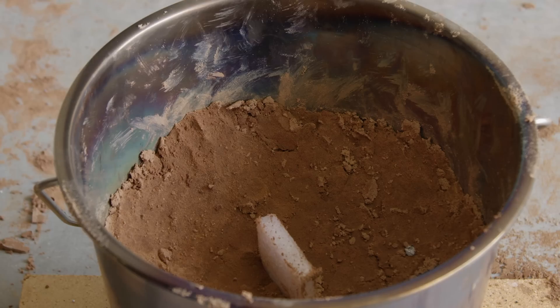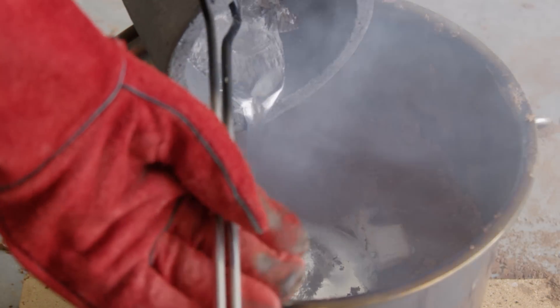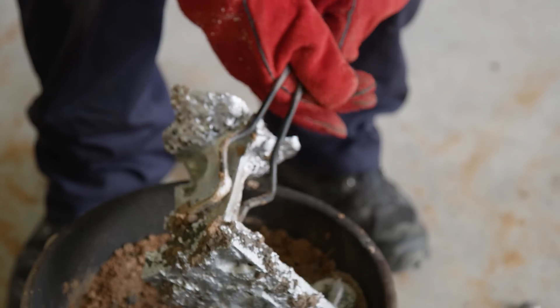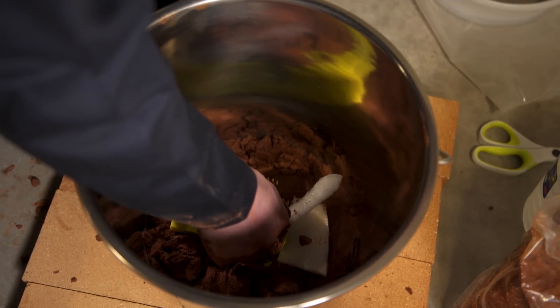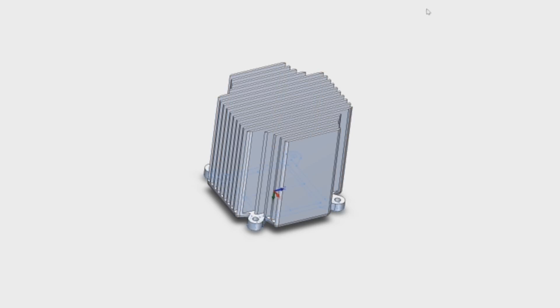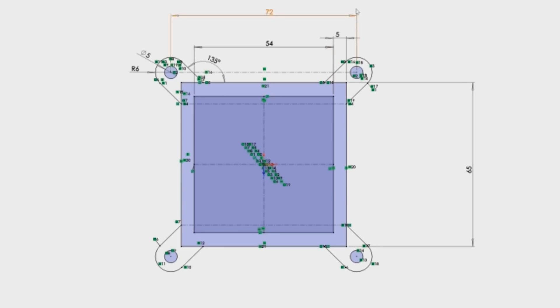So, casting — we're talking about the kind of casting where a molten material is poured into a mold so that it solidifies in the desired shape. There are a couple of important elements that you need: a foam or plastic replica of the intended finished design, and a material that you can mold around it that can hold its shape. The primary design considerations for our heat sink were how easy it would be to cast and how much heat it could dissipate.